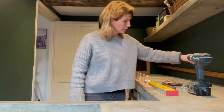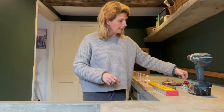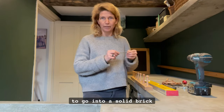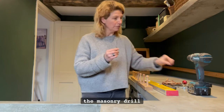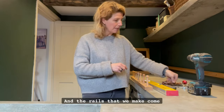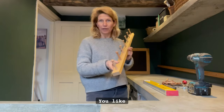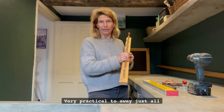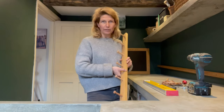It's all in the preparation, really. I have a very pointy thing that marks the wall accurately. I know that my peg rail is going to go into a solid brick wall, so I also have the correct piece, the masonry drill, and the correct wall plugs and screws to go with that. The rails that we make come in — you can order them in any length you like. It's ideal for putting up on the whole wall of a room, very practical way to store things. So it's all about the setting out and preparation and we will get going.